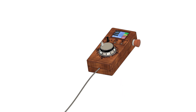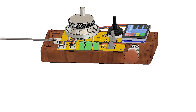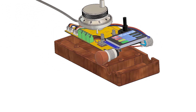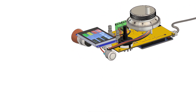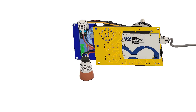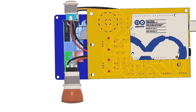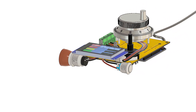My pendant is controlled by an Arduino Leonardo, which makes a serial connection to MACH4 via USB. The pendant itself has a 2.4-inch Nextion touchscreen, a handwheel to control the axis, a rotary switch to select the axis, two encoders to manipulate the speeds and feeds, a confirmation button to validate the important functions, and an emergency stop.